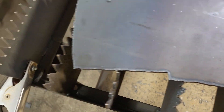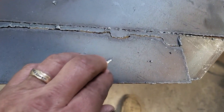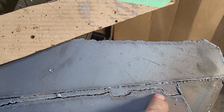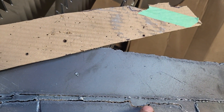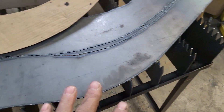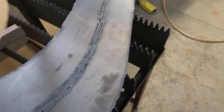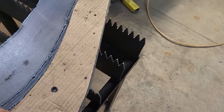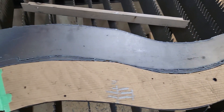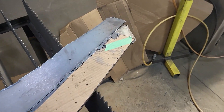These are the two pieces — the waste is in the middle — and I hand-cut them. I don't have a CNC; I use a straight edge where I can. Looking at the bottom side, I color outside the lines — this is the waste here. I took one piece and started outside for the shape of the rivets, and I'll clean all that up with the carbide burr. Then I'll clamp the two together — sandwich them, clamp them on the ends, chuck that in the vise — and smooth everything down. That's how I did the front and the back, using the cardboard as a template.